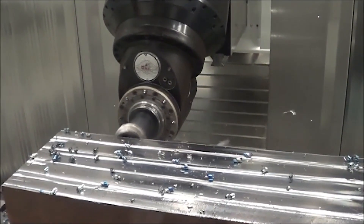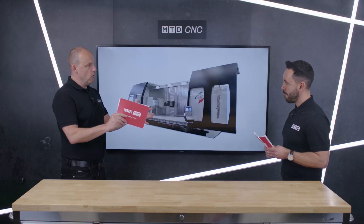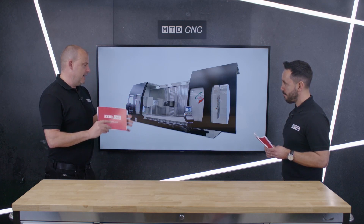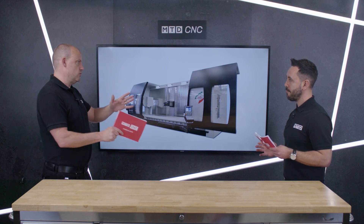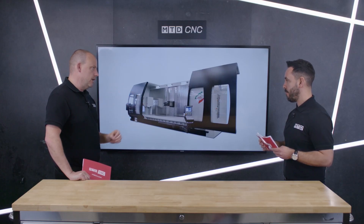What's important to mention about this head as well is the RAM. This RAM is almost like caged in a box-in-box construction, which means it's fully supported as it's moving in and out on its axes. If you've got a 1.2 metre Y axis, are you going to experience droop the further out of the end of the table you get? So the better the construction around that spindle or that RAM, the better. That all feeds into the head technology here. All-round rigidity to dampen any vibration, cooling of the spindle, reducing growth — all of those things are part and parcel.